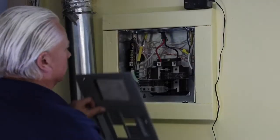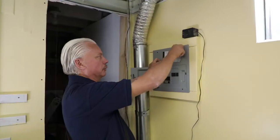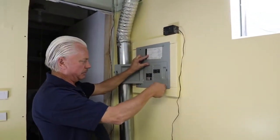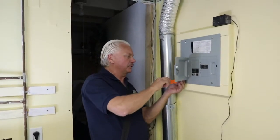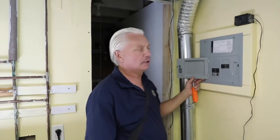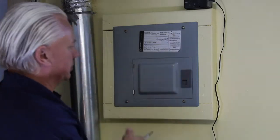Now we're going to put the panel back together — put the dead front cover back on. Make sure you put everything back together, be safe, and remember — normally you want to wear your face protection and safety goggles. You want to put your flat-tip screws in, just like the main panel. We took another picture to show everything is exactly where it was. We have everything back together, so now we're done with our panels and we'll start going through our interior electrical. Once this is together, we'll have to check a representative number of outlets, our smoke detector locations, our carbon monoxide detectors, and our lighting systems.